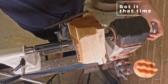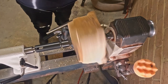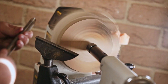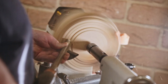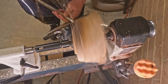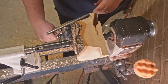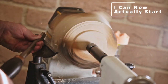Claret ash is really soft, it's quite nice, and it's fantastic to work, but the teeth had not sunk in and therefore it was spinning. So how I fix this is pushing the tailstock a bit tighter, which locks it in more firmly on the spur. I've just used the long wings of the long bowl gouge, and now I'm going to turn it around, do some push cuts up the side, and try to get it up to round.